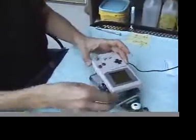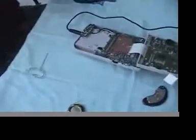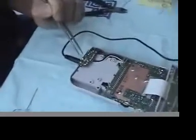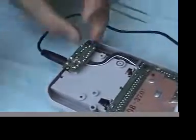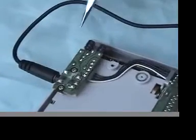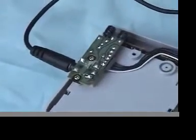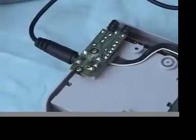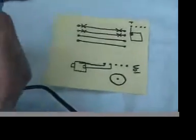That is the LTC module. What we will do now is add the ProSound mod. The ProSound is basically the bypass of the headphone amplifier section, and by some accounts it sounds better — I think that it does as well. Some of the ways posted online involve actually adding a jack, but what we will do is basically patch right to this. There is a volume potentiometer which we will solder to, and it's these points right here.